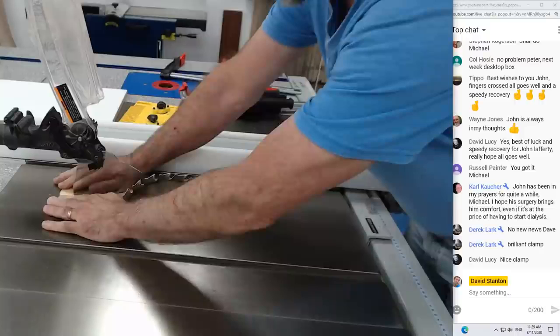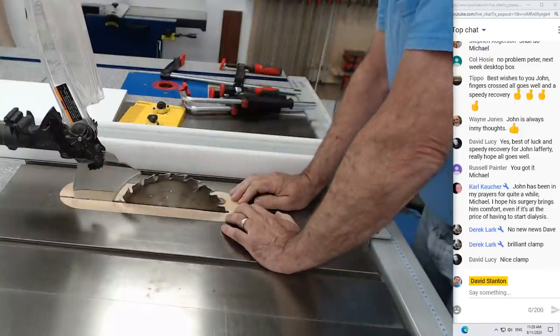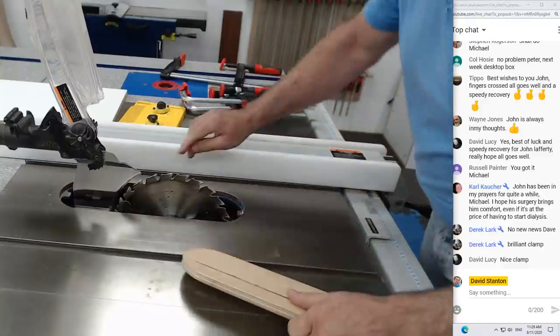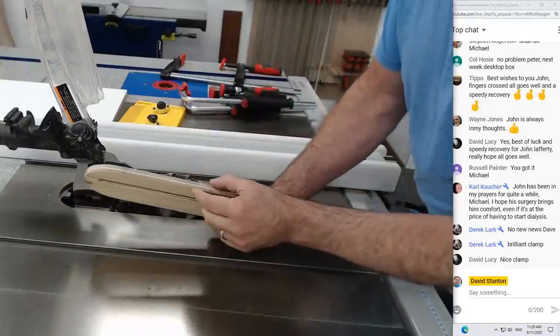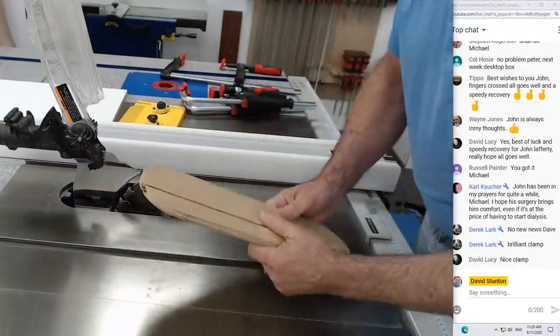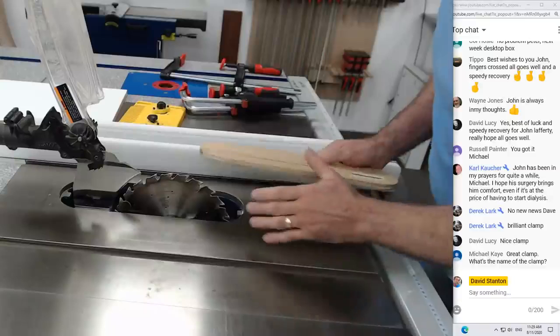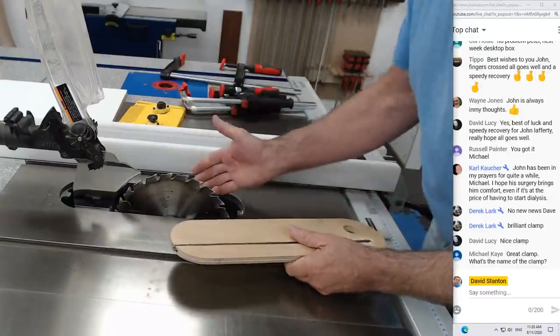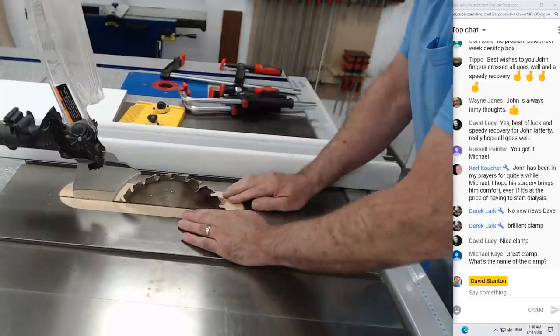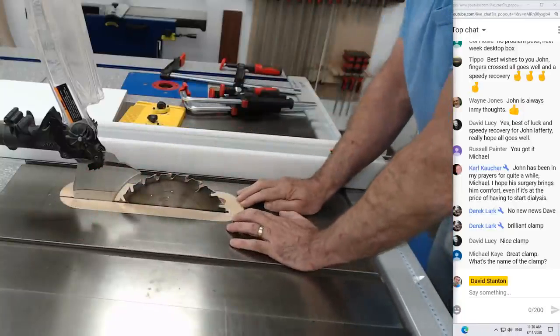I love making my own inserts. There's a saw at the moment that I like. It's basically the one after this. The only thing is that you can't put an insert that's this thick. It's only about that thick up at the top here. But there's an aluminium insert that you can buy to put in there, and you raise the blade up through it and it cuts its way through the aluminium. So it's a zero insert plate for it. And that works all right.